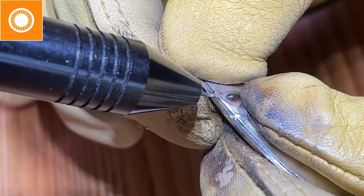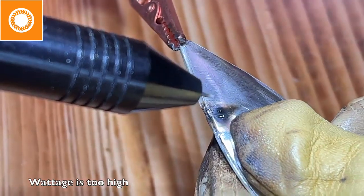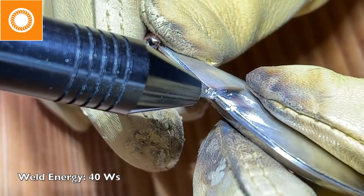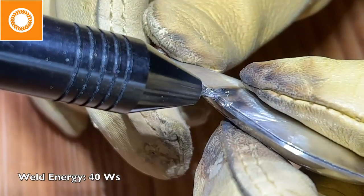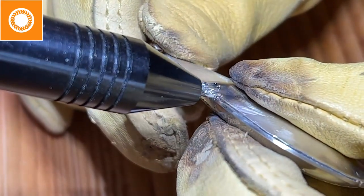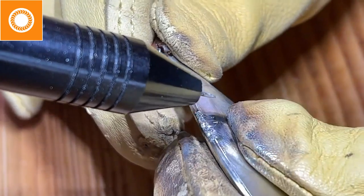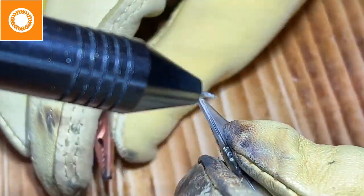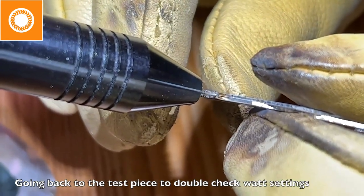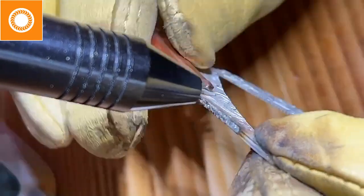Back to it at 45 watts — and I'm still not liking it, still getting some splatters. So I take it down to 40. Now at 40 watts, things are looking much better. There are still a couple of little splatters, but 40 is giving me a nice deep weld, and when I go back over it I'm able to smooth them out. I keep that test piece close by to double-check my setting and make sure it's really working.